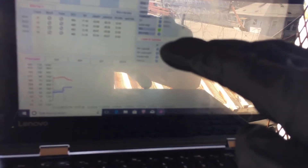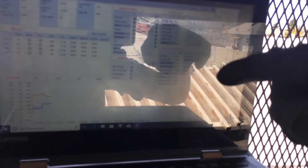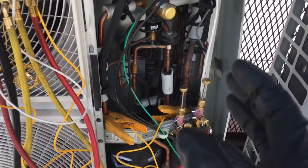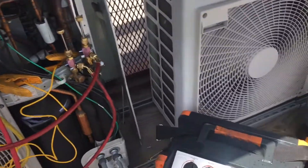You do not need gauges on these systems at all. Every pressure, temperature, and superheat you need is located right here — there are temperature sensors on the inlet and outlet of every air handler downstairs, and on the suction line. On these systems you can take the superheat right off every head under load, because everything you need is already built in. It's kind of like having MeasureQuick already hooked up — your Field Piece, your Testo — it's all here. All you need is the software and your laptop.